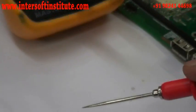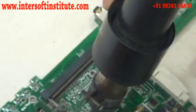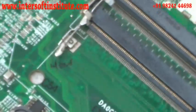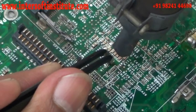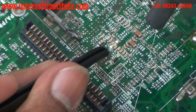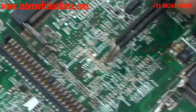We can check a diode like this: one side it will pass power and the other side it will not. We will insert this diode back on the board. With the BGA machine — you can use a micro iron but it is slow — we place the component on the board, apply solder paste, and it will stick easily to the board.